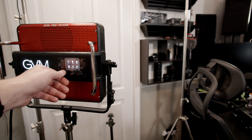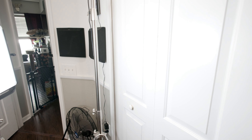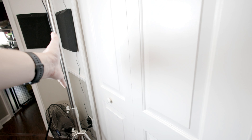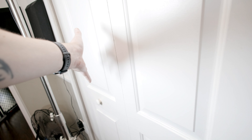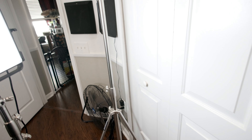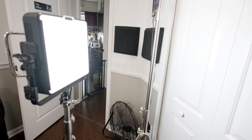Let's talk about why I like edge-lit LED panels — the diffusion. There are times you want specific spotlights with harsh lighting; this is a floodlight that fills the whole room at about 120 degrees. But because it's diffused and soft, look at the shadow cast by my hand — you can't even see the fingers. Less than an inch from the wall is where you finally see the shadow forming. With direct LED panels or COB lights, you'd see basically a handprint even with your hand this far away.